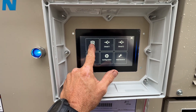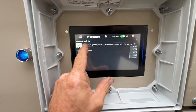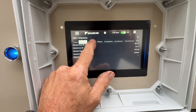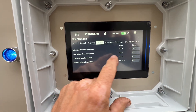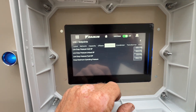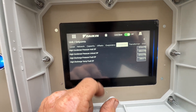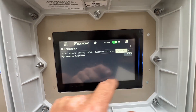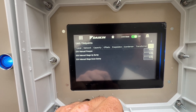While we're waiting for the load, let's check out some more of those setpoints. Cool setpoint was 44°F. Network enable is disabled. We can change our temperature offsets — nothing's been offset there. Evaporator pressure switch settings, condenser, transformer temperature, and expansion valves — you can manually open and close those.